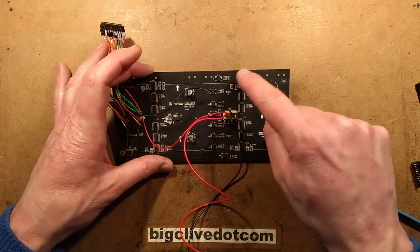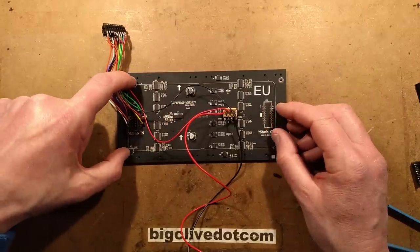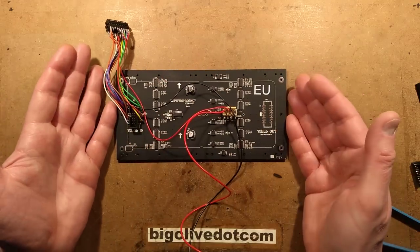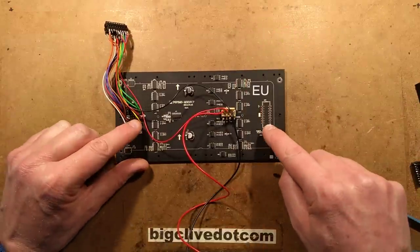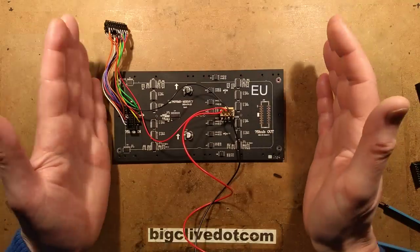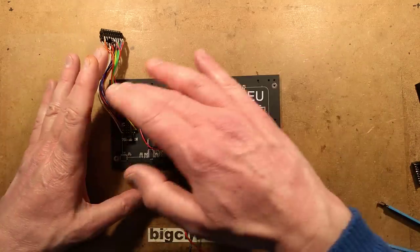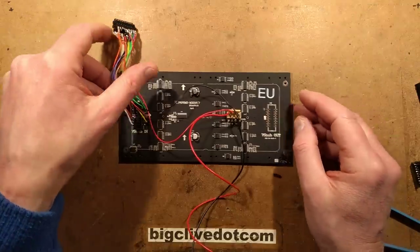The MOSFETs are dual packages, probably in parallel, driven off a simple traditional logic chip. There are also a couple of octal bus drivers, which I think are used to gate the information coming in because you can cascade them and shift data from one panel to the next. Due to the limitations of multiplexing, video wall modules tend to come as a block with a small number of panels plus a dedicated controller at the back that connects to a series of them and shifts data across as a predefined clump.